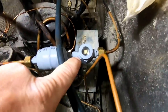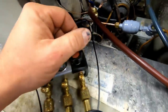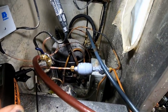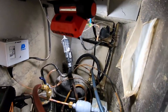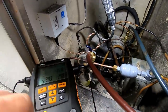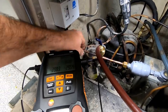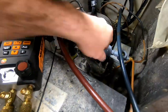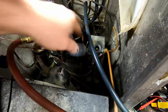All right, you can see we're probably turning three in there. Just with a generic manifold, pulling the old-fashioned way, doing it the way we used to do it for 20 to 30 years. What we're going to do now is go ahead and charge this thing up and see what we can get out of it, see if we got any circulation issues. I went over top of my pinch-off tool spot and put a little bit of braze around it to reinforce it so it won't collapse on me later since it's kind of on a weighted spot.